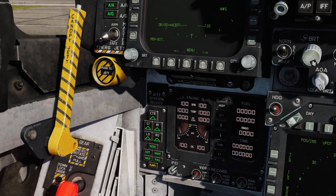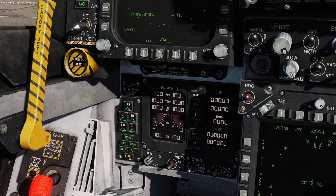Down here are the flaps indication lights — half and full. A yellow flaps light is a warning: the flaps have been raised by the flight control system but the switch is still in a down position. For example, if you take off at full or half flaps and forget to manually flip the switch, the FCS computer will bring the flaps up to prevent damage but this light illuminates to let you know. You also have your nose, left, and right landing gear position lights, and the jettison store selection switches — when illuminated, that's the store selected.